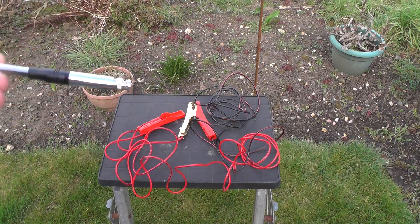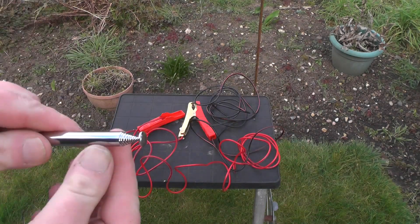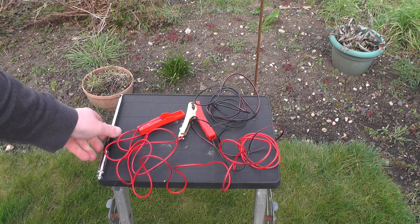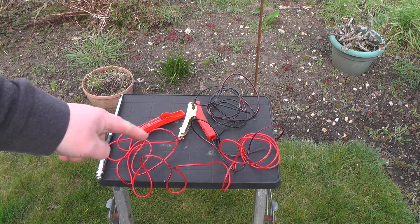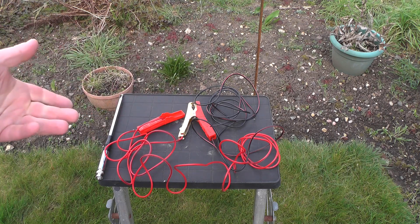On the end of the antenna you've got a BNC plug that connects to your handheld radios, and you extend the telescopic whip. Also we've got an alligator or crocodile clip — I've got two of these from Amazon, round about seven or eight quid for both. I've got some speaker wire, about five metres from Amazon, around five pounds or so. All we're going to do is add the speaker wire as the counterpoise.